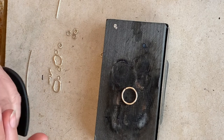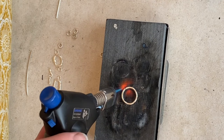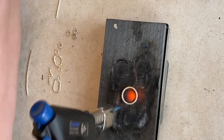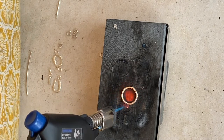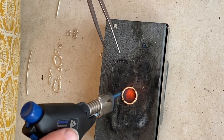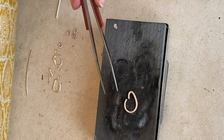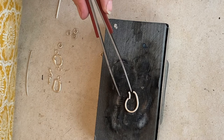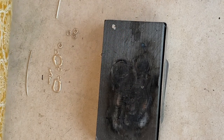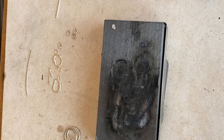This is just so that you understand it's not an idle warning. I'm going to bring the whole of this jump ring up to temperature and get it to the bright red stage — it's a shame I'm wasting a jump ring here. I'll do the demonstration and hopefully it will work, and if not, that's the joys of television. So that is very hot. If we had this under the studio lights it would be glowing. So if I touch it at this stage — exactly, that's exactly what I wanted to happen. You can see that the metal actually breaks. Now, on a demo I did earlier, you will have seen that there is still some possibility of being able to fuse it back together again. It doesn't mean if you've broken it you can't use it — if you're lucky and careful you can generally get these things back together again, unless it's something very complicated.